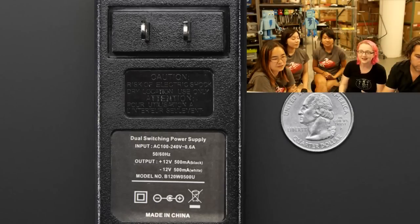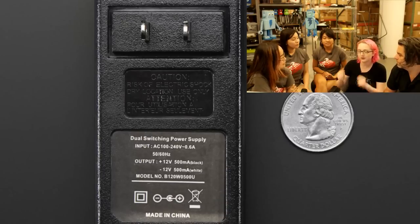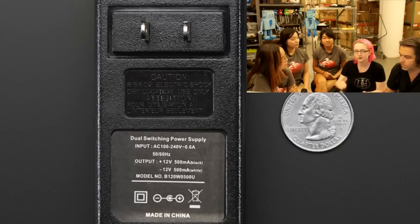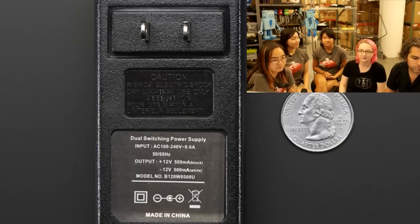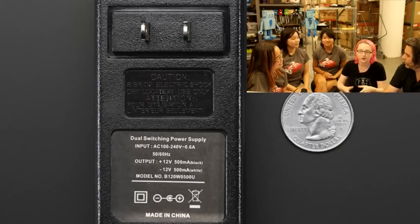It's pretty sweet. It's not like the highest quality supply — it does droop, it doesn't give you a really solid 12 volts — but you can always put a regulator on it and bring it down to 11. But this is pretty much it, and we bought a thousand of them, so hopefully people will like them. It's great because it's safe. You don't have to do any transformer work, there's no mains, you get plus and minus 12 and you're ready to go.